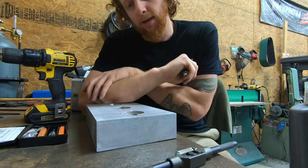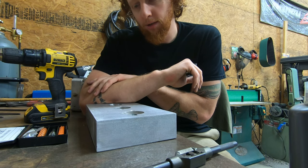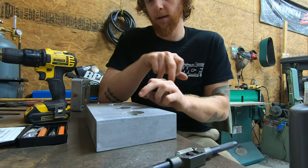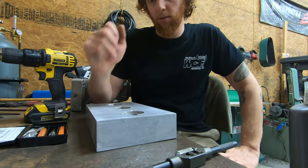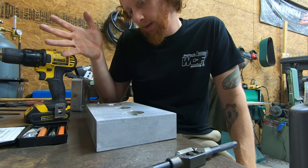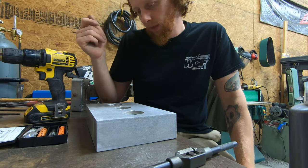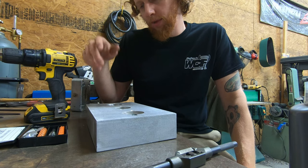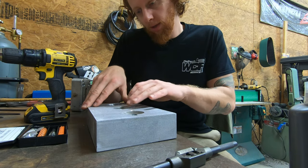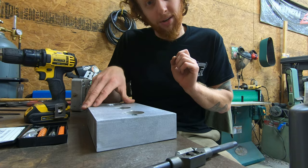So once this green Loctite dries, these steel threads, I'll never have any issues with those. And I may even go ahead and put these threaded inserts in the rest of these holes, although I guess I am one Time-Sert short, but I can at least do 4 of the remaining 5 holes. That way I'll never have any issues with any of these other holes and everything will be good to go.